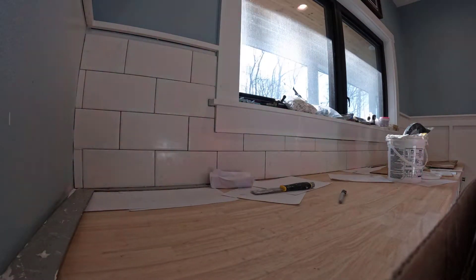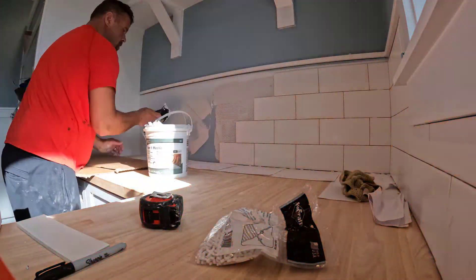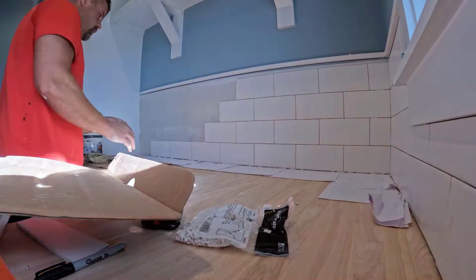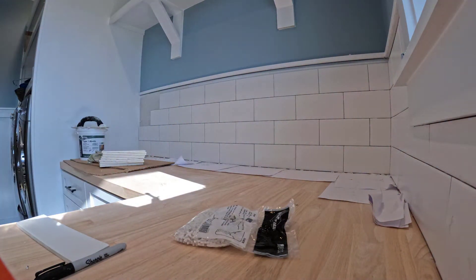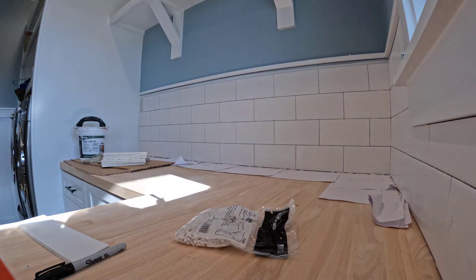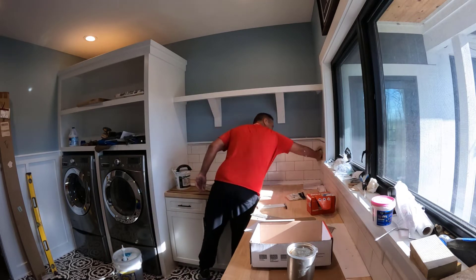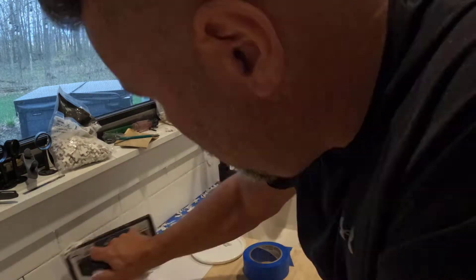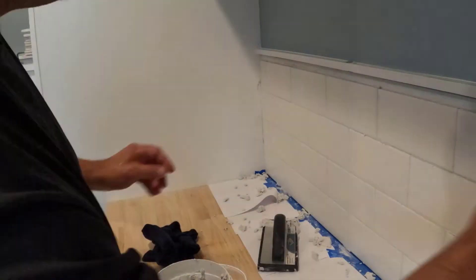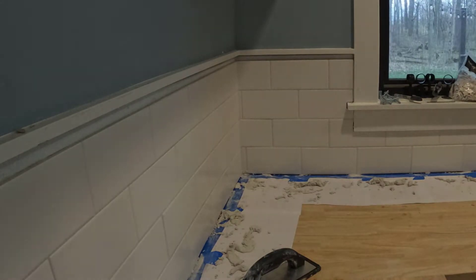I'm using mortar from a bucket. I like to buy mortar and grout pre-made in a bucket — I don't do that much tile work, so mixing it from scratch is just a pain and it's not that much more expensive. Tip: just use the pre-made stuff, it's a lot easier. These are three-by-five tiles I got from Menards — I'll put a link in the description. I left a quarter-inch gap around the entire perimeter where the wall meets the countertop because I knew the tile would cover it. I'm wiping down the tile to make sure it's clean before grouting — it's a lot harder to clean mortar after it dries than when it's wet.